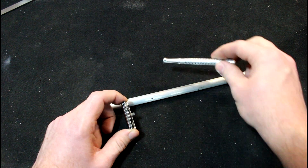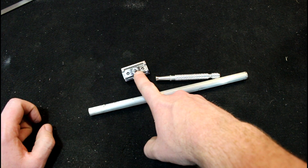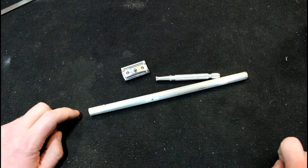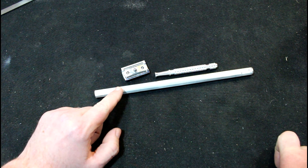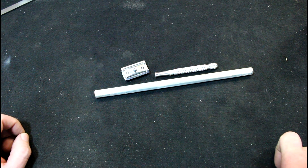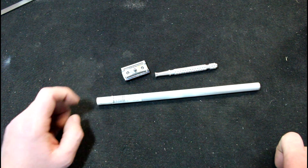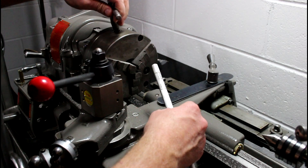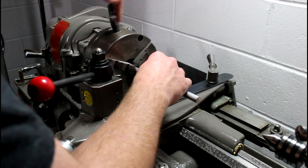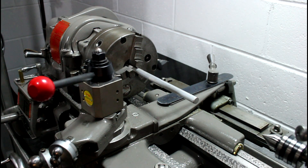What I have here — I think it's a 10-32 thread. I don't have that tap right now so I'm going to have to order one, but I can do everything else. Here's just a chunk of half-inch aluminum rod, picked up at a hardware store. Not too difficult to come by. I'm gonna chuck that up in the lathe. I'll slap this in my three-jaw — I could use a collet but it doesn't really matter. First thing we gotta do is figure out how long it's gonna be — just kind of a random thing.